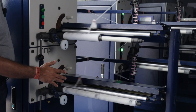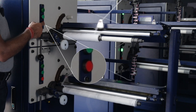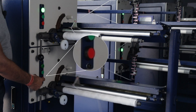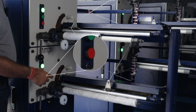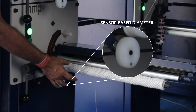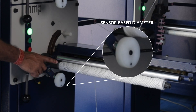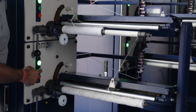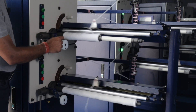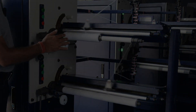If you want to stop the machine manually, you have to press this particular red button and the machine will stop. Similarly, for the 20 inch, you can stop the machine over here. But you do not need to stop the machine because you have a sensor-based diameter control. When the cartridge achieves the diameter where the sensor is, the machine will automatically stop. Hence, we can keep the production of the machine going on.